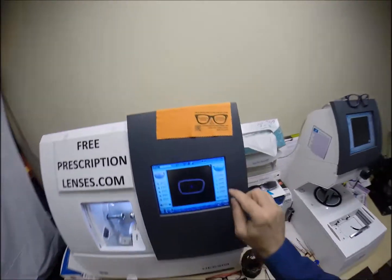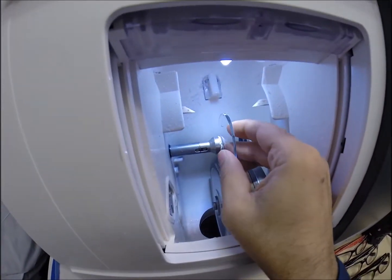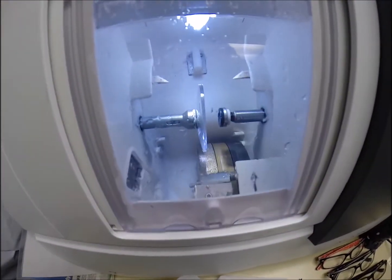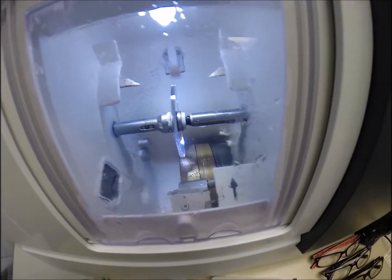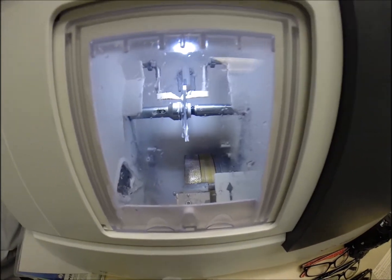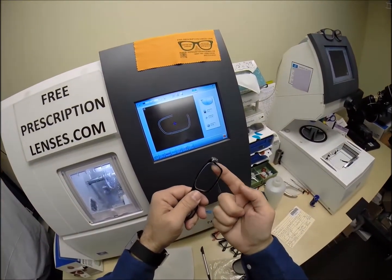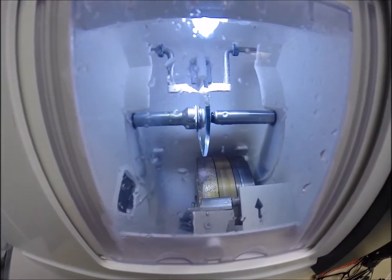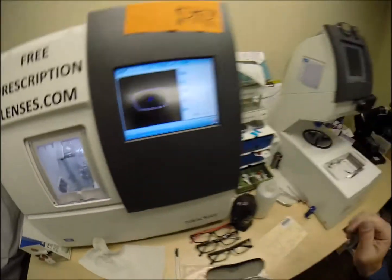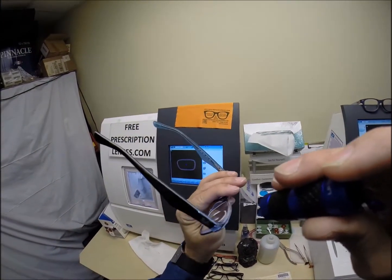Let's go ahead and start cutting the left lens. We're going to flip that over to L. We're going to allow the magnet to attach itself to the Charles — the Chucky, the Chucky baby. Hit the green arrow, which is started in every language. The door closes, the clamp shuts, and then the lens is going to be traced just like the first time by the two white styluses, making sure that it's large enough to fit into the frame. You can see as it's going around tracing the shape, and then just like before, measuring where to place the bevel so you have the least amount of edge thickness showing — or essentially the best cosmetic look. And you've got no edge thickness whatsoever.